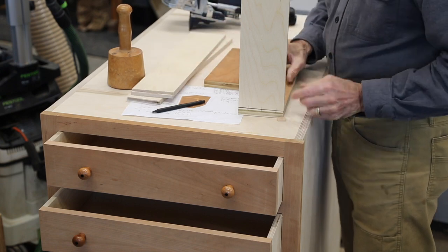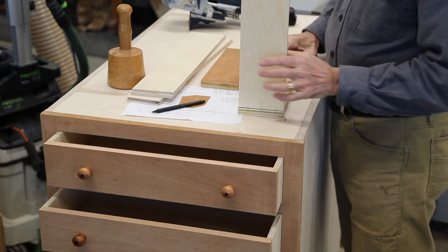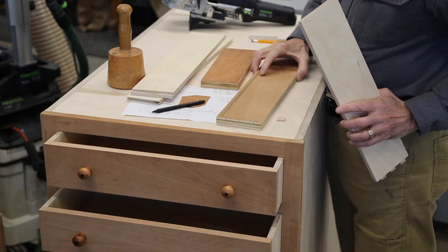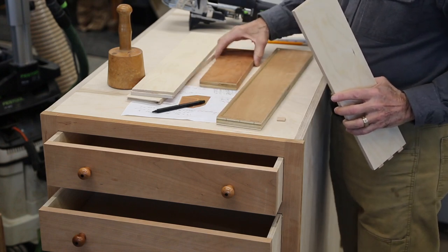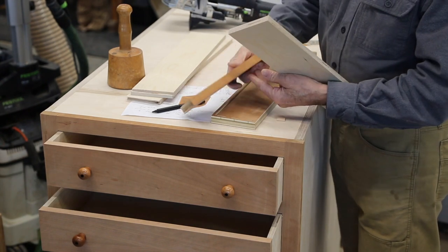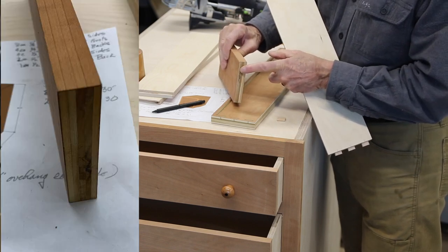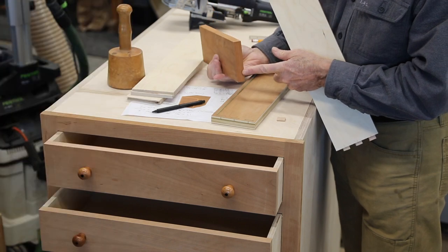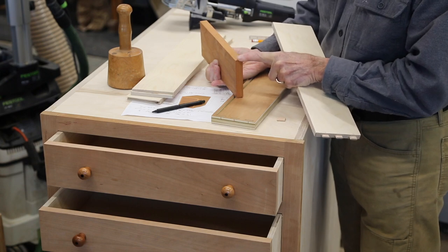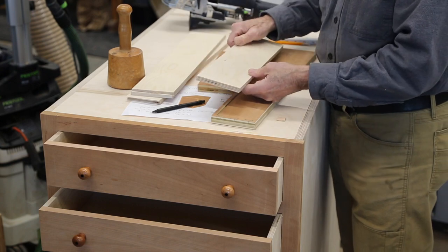I used that for the back of the drawers, but the fronts of the drawers are made from plywood — high quality cherry faced plywood, $108 a sheet last time I bought a sheet. I edge banded it. This is a piece that's got edge banding on three sides; there's your plywood core, but on the other three sides it's edge banded. You always do the ends first and then you have the tops and bottom veneer overlap that. A few people would notice that that isn't solid wood.